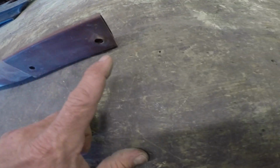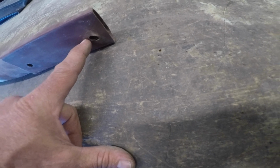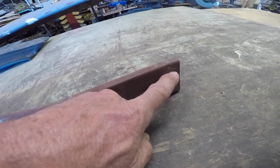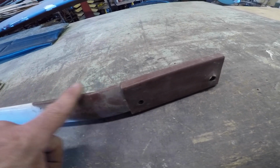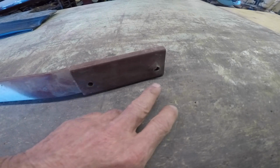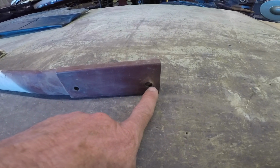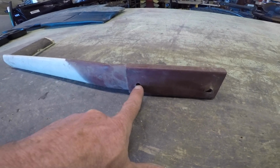The reason for that is, should you ever have a problem, a gear collapse, you shatter a fiberglass main, anything like that, when this breaks, it's going to pivot about here, and this is going to swing down from its location and not hit anything. This will shatter the fiberglass fairing on the back, but when it rotates, it won't do any damage. That won't be true if you do it the other way around, because it will shatter the wing root. So the aluminum bolt goes in the top. The steel bolt, which becomes the pivot, goes in the bottom.